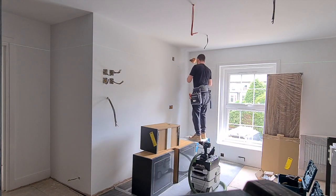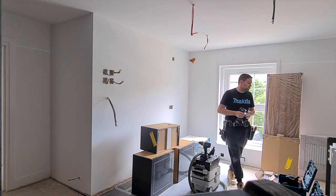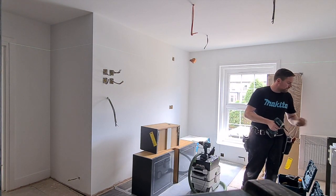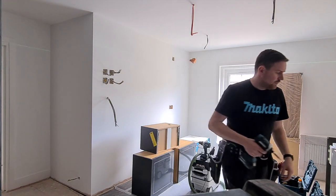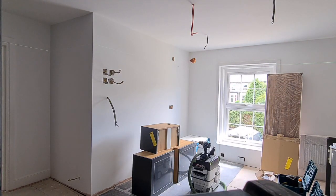If you don't feel like the screw has grabbed very nicely, then don't use it. Come up with a different method, get a plasterboard fixing in there. You know, sometimes I put a raw plug in, but I cover it with expanding glue before I bang it in, just so that it gets a bit of extra grab and won't pull the plug out over time.